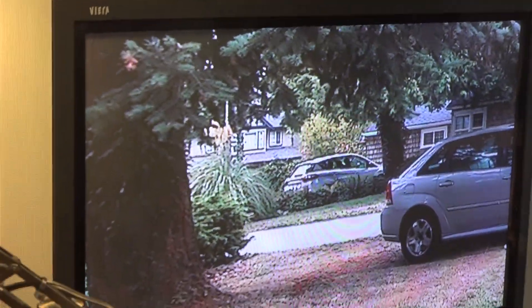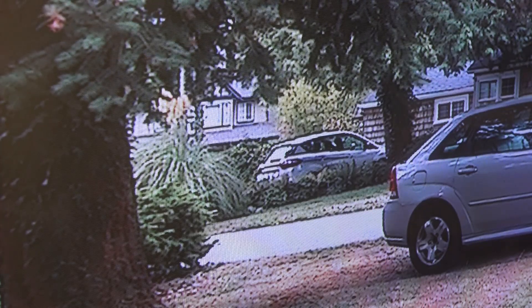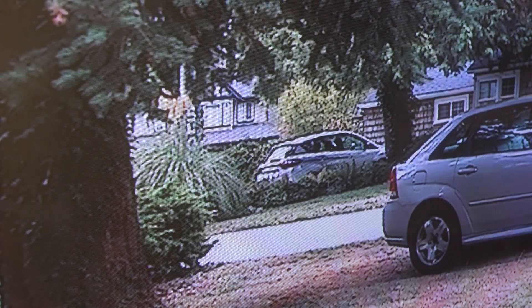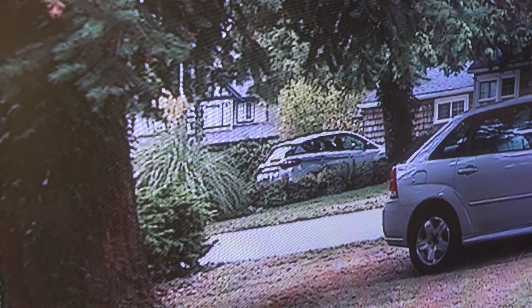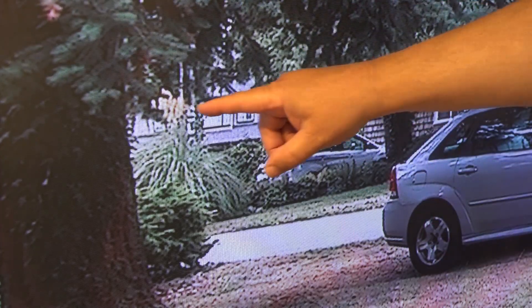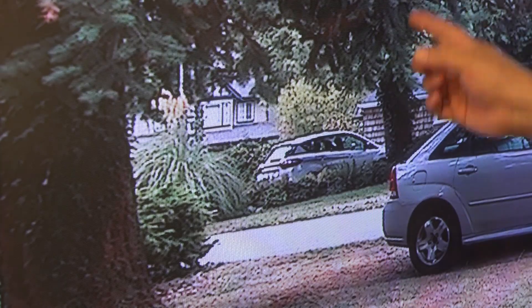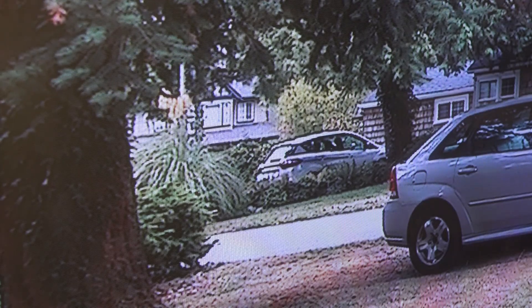Just wanted to do a quick one to show you that — so when you're looking at when I've been using this tube camera for my locked-off images for testing some of these old video devices and you're seeing the vertical stripes, that is what the vertical stripes are. All single tube cameras will experience that phenomenon when viewed on high resolution. This plasma screen is not high definition — it's standard definition, 852 by 480. VHS would resolve about 240 vertical equivalent pixels and 480 horizontal pixels; Beta did 260 to 280; three-quarter inch did 330.